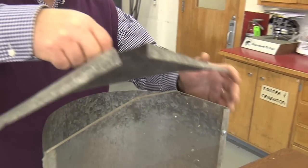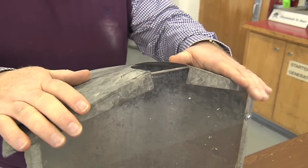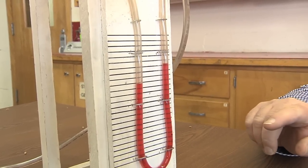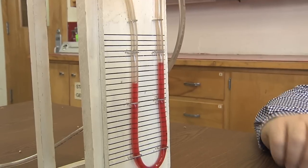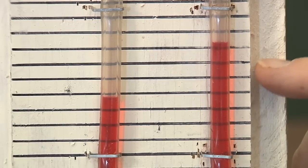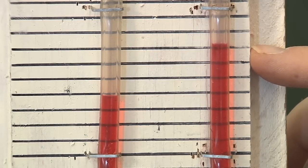It's important that we always level the grain so we get uniform airflow coming through the bin. We'll put the bin roof back on and take a look at what the static pressure is. We're looking at the resistance to airflow through the floor, through a shallow layer of wheat, and out through the bin. What we're seeing is about three-quarters of an inch of static pressure — that's the amount of pressure the fan is having to develop through the floor, through that shallow layer of wheat, and then out through the top of the bin.